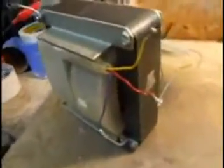I've put a couple of paper clips just to form an arc, just to show that the transformer actually does work. I'm going to power this with a variac — it's a 0 to 120 volt variac — but I'm not going to let the input voltage get over about 30 to 40 volts input, because normally this transformer is supposed to be operated immersed in oil. If you don't operate it immersed in oil at full voltage, the windings will arc internally and damage the transformer. So we're just going to keep the voltage low.